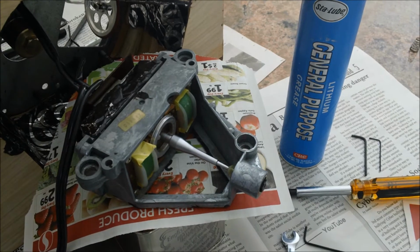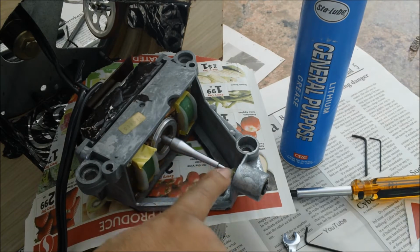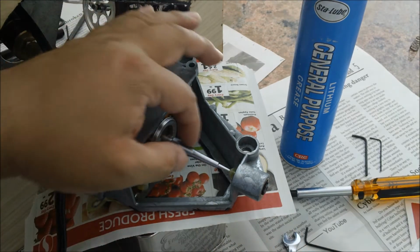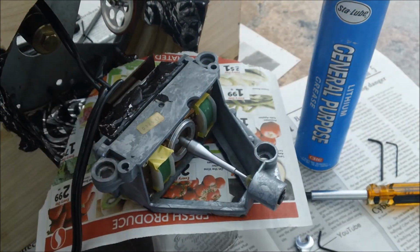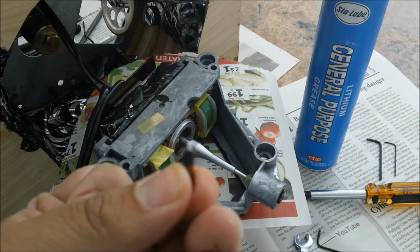Today I'm going to talk about repairing my Lenco L75 motor. I accidentally broke the nose screw plunger that actually regulates or holds still the spindle. The screw goes in here and it goes up against the spindle to keep it steady. So my first attempt was to order